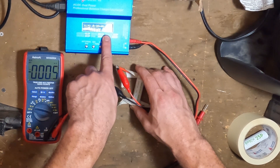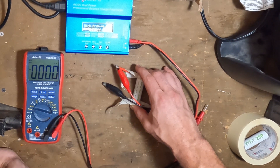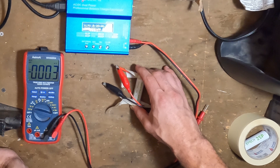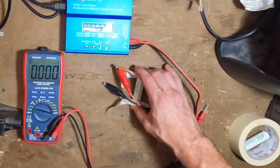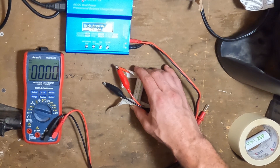You'll be able to see the voltage increase here. The voltage is going to increase to around 2.5 volts — you want to get it up to 2.5 or 2.6 volts using this method. It's not going to take very long, maybe one to two minutes if you're using 0.1 or 0.2 amps. Then once you charge it to just over 2.5 volts, you're going to transition back to the lithium-ion charger and continue to charge it there.